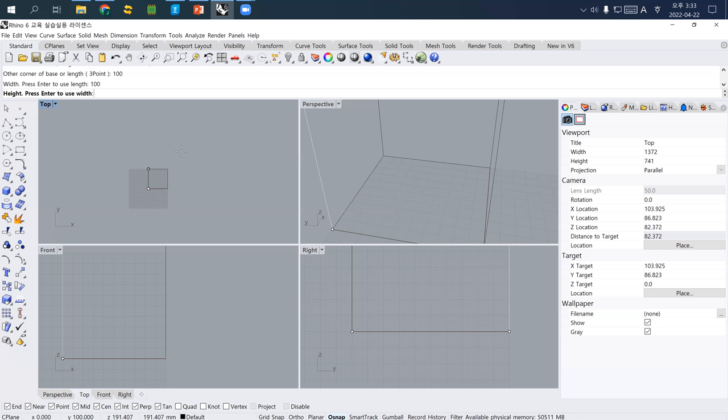Whenever we see a construction site, where they attach many places using MDF for finishing material, they just glue some boundary area and do it like this. This is a really lousy way of construction. What we have to do is this: no empty areas. We paste wood almost everywhere. Otherwise, some part will just pop out because it isn't held, and we don't know where the cutout area will be. If you cut out this one, everything will separate because there's no glue.